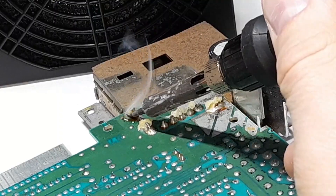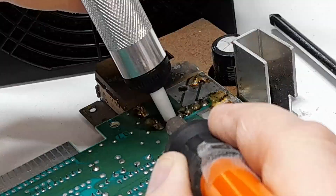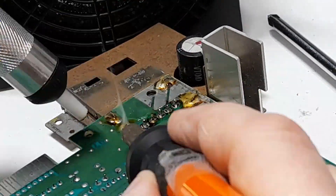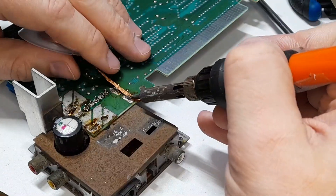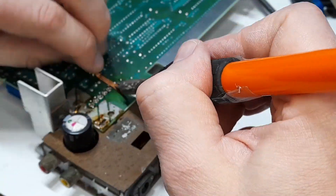To replace the capacitors inside the power box, we're going to have to remove it from the main board. This is definitely the biggest chore when doing this, and I've yet to do this without accidentally setting off the smoke detector. Some folks have suggested pulling back the top lid on the power box and just replacing the capacitors while it's still attached to the board. However, I'm always worried I'm going to damage something if I do it that way.